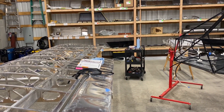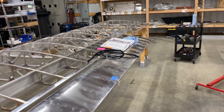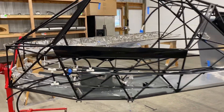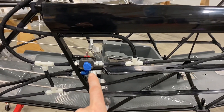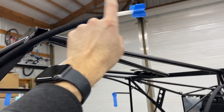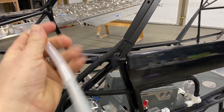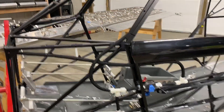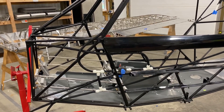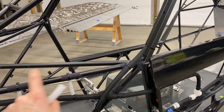I'm waiting on a couple of rivets to finish up the clips on the aileron, flap ribs, and nose ribs, then we can finish up the wings — hopefully this weekend. Starting at the fuel selector, this line's pretty simple; it just goes up to the left front tank. You can see the white fuel line in the sheathing. Anywhere it's attached or crosses anything, I put the thicker sleeve on there — about twice as much sleeve as they provide. My biggest concern in aviation is in-flight fire, and this stuff's like 50 cents a foot, so I went a little overkill. I also used friction tape anywhere it's attached.